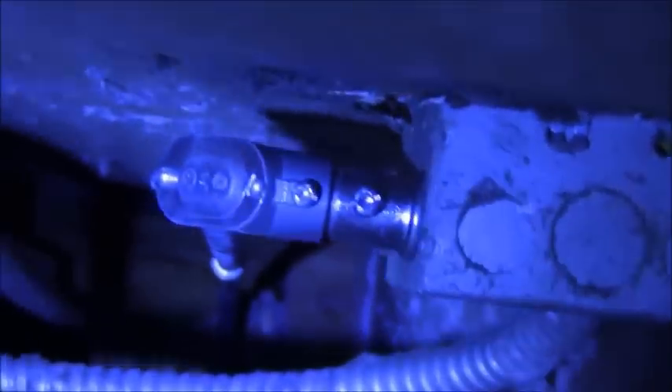Now I'm going to show you the conduit run that I did behind the wall here, traveling up, coming across that way. I'm going to turn my flashlight on so you can see it. This is where I ran half-inch EMT. Here's the chase — and there's my new run right there. I just went up and then turned into the wall there at a 90-degree turn, right way up there. They used flex, but I noticed that the flex kind of collects a lot of dust, so I'm hoping that with the half-inch EMT it will be a little bit cleaner. That came out pretty well — so that's inside the chase.